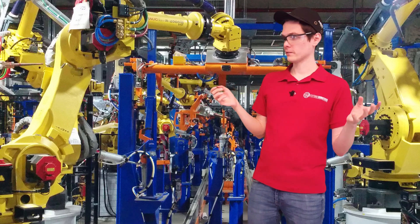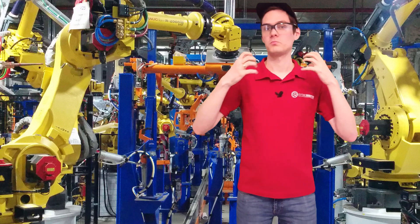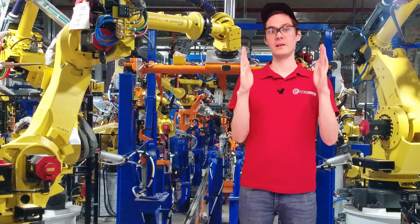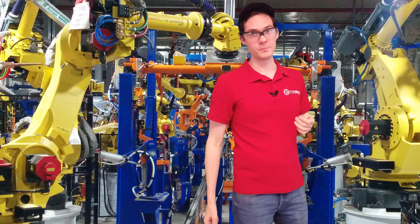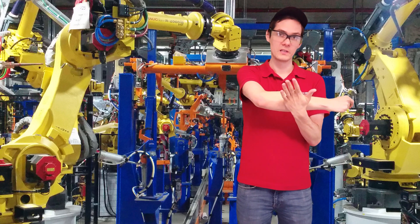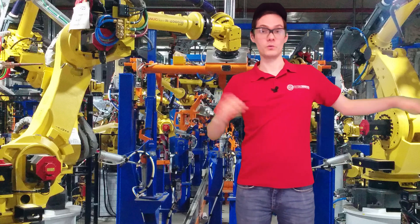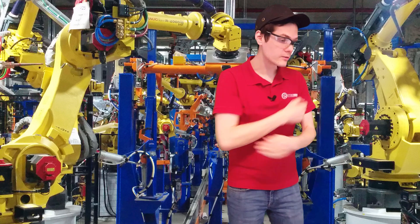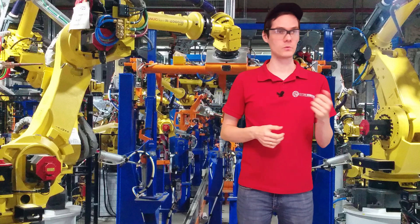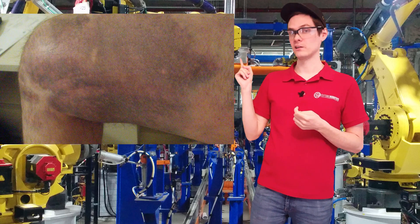I looked and my friend was just shaking. He screamed, 'Drive it back, drive it back.' Then I realized his leg was smashed between the pillar and the robot. He was looking at the TCP at the end of the welding gun, checking if it wasn't scratching anything or the hoses weren't being pushed against something. But he forgot that the gun is that long, so he wasn't watching the wrist of the robot — and that's what hit him. This was T1 — we weren't doing T2 or anything, we weren't in a rush, just driving the programs. It took one second. That was enough to smash his leg — that's what it looked like after two hours.